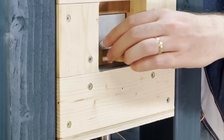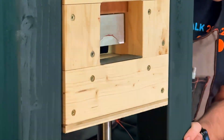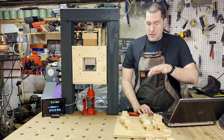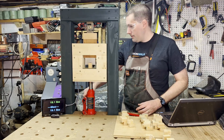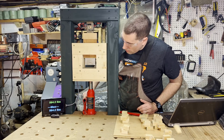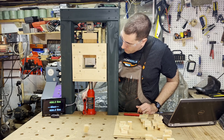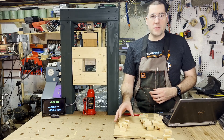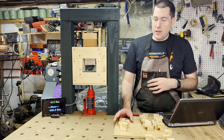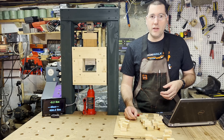That was 408 pounds — that's all the two and a half pound ones tested. Now we're up to the 14 pound ones. All the ones that had clamping pressure of about 14 pounds per square inch were very consistent, right around the 470-500 pound mark. However there was one outlier that was only 200 pounds — it looks like a good failure so I'm going to look at it more closely and we'll see at the end.